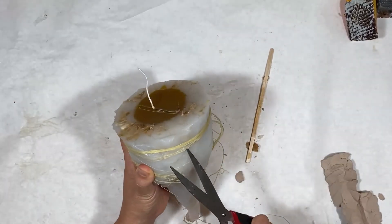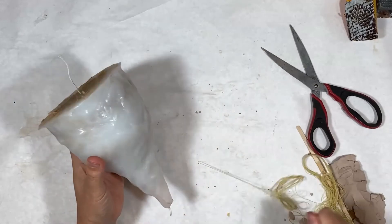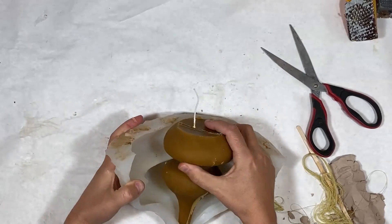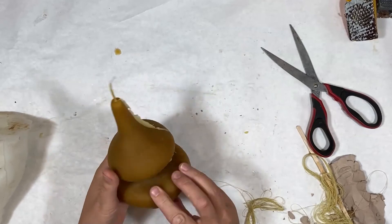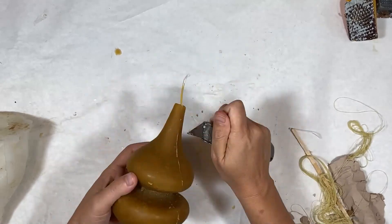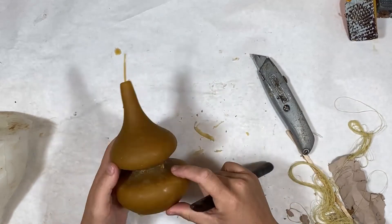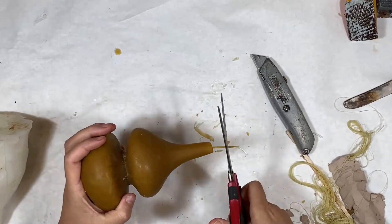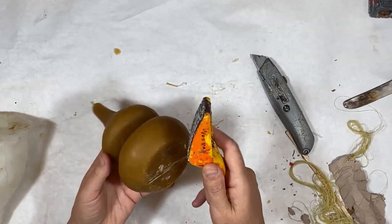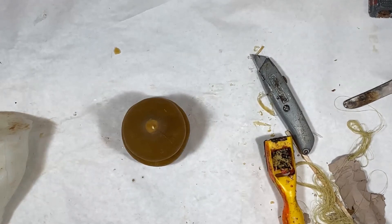I was just looking to see where that seam was. To open it, you just go from that seam and pull it out. Now to do a little bit of cleanup — because there's always going to be a seam on your casting where you had cut that silicone mold — I like to use a butter knife for that seam. If you have some extra pieces around your piece that are little chunks you didn't have before, that most likely was a hole in your silicone mold, a little air pocket. I really like to use a surform to shave the wax or plaster as well. And that's it.